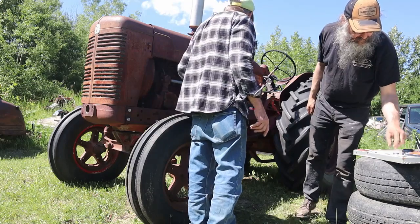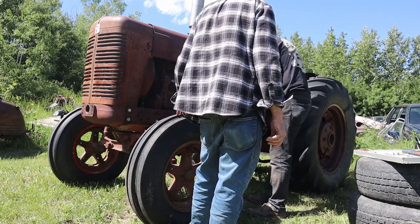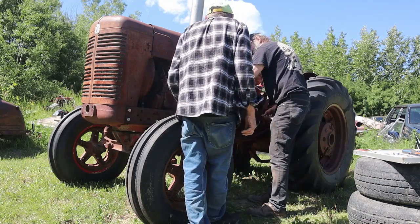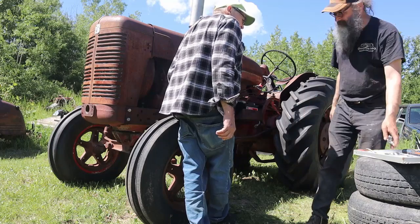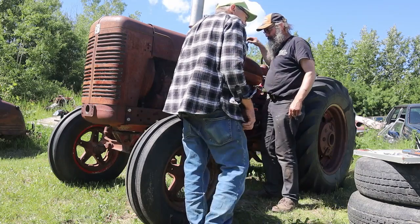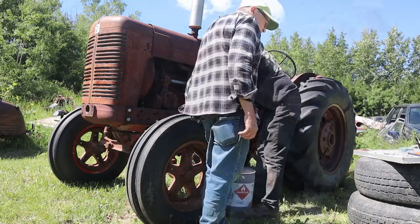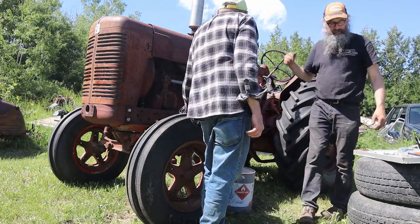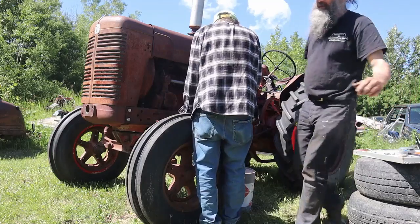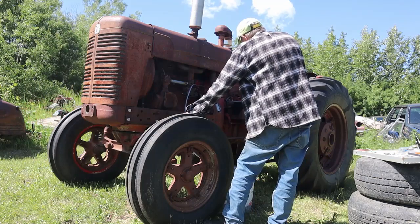Before you do that, pour some gas in there so it'll run out of here. Sure. I just want to get into the tank. Before you hook this line up. Yeah. Fuck, that thing runs nice. Runs like new, man. We'll pour some in here. What we should do is put that line on and pour it right into this tank. That'll be good enough. So I'll dump a liter in there and we'll just slosh it around, and we'll see what happens. If it's super gross, then we won't bother. But if we can get clean gas to come out, that's good enough.